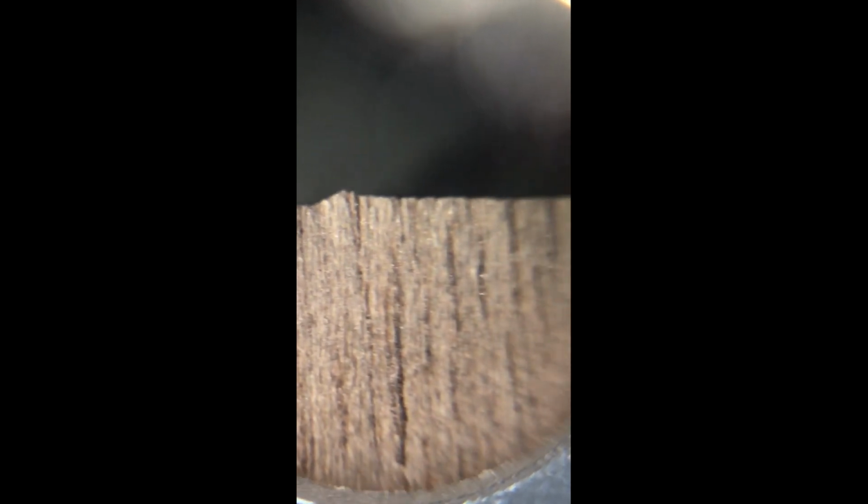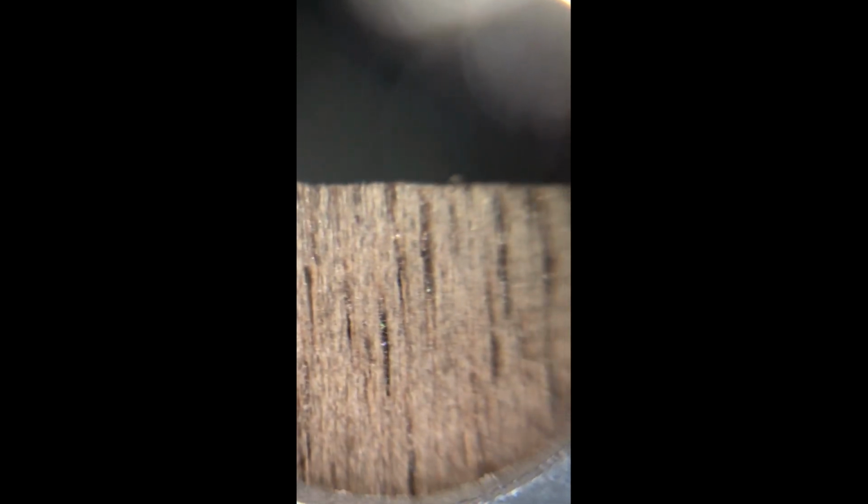Now we'll take that same trip with the cut made with a spiral blade, and you can see that even though I tried to stay right on the line, I was not able to maintain the quality of that line nearly as well as I could with a flat blade. So this is the disadvantage of the spiral blade. Although we can cut in any direction, it also causes us to more easily wander off of the line and we get a much poorer cut. Now there are tricks you can do to make this better, but I was just trying to follow the line.